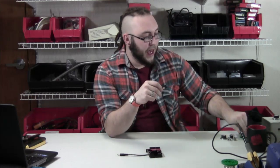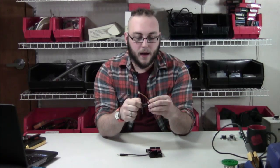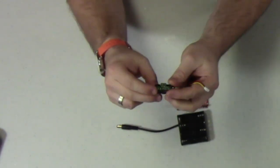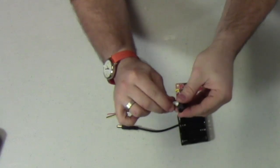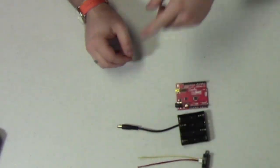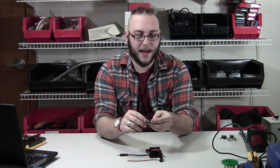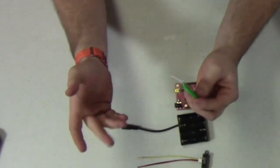To make this easier to hook up, we actually have this wiring harness available, and I put this on the wish list too. You can solder directly to the lugs where the JST connector is connected to the board, but if you do that it can be a little fragile and a pain to get the JST connector off. So we like to use these — they just snap right into the sensor, and then you've got these nice long leads that you can strip and solder to your project. We also have the speaker. This is our smallest speaker — a little thin 8-ohm speaker that you might see in a talking greeting card. It's not very loud, but after playing with this instrument for a couple minutes, you'll agree that it's loud enough.